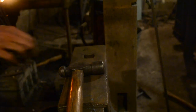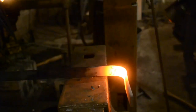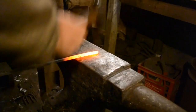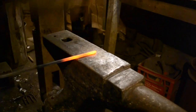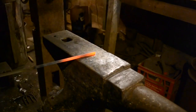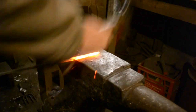People conducting these tests go through and they analyze some historical examples. They measure the chemical composition of the steel, they measure the tensile strength, the hardness, etc. Then they look at modern steels and try to find one that's roughly comparable. This is an understandable area to neglect. Nobody produces historical wrought iron anymore, and the only people producing bloomery iron are amateurs. As such, if someone wanted to make a reproduction out of historically accurate iron, they would either have to recycle antiques, learn an extremely difficult, temperamental, and time-consuming craft, or pay through the nose to have a specialist produce the metal.